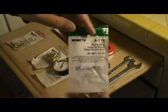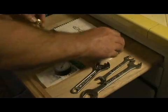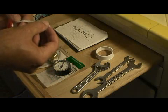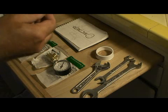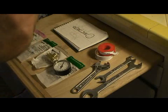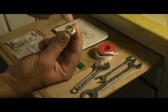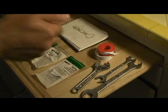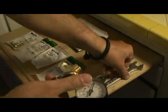This is the piece that we started with to begin with. It has a smaller diameter — it's a 3-8ths by 1-8ths because our valve is a little 1-8th jobby. Now we'll throw some more Teflon tape on this. One or two loops around should do the trick. I'm just going to make sure that I keep any of the Teflon filaments out of the hole so that it doesn't get into the system. So then this goes on the end here.